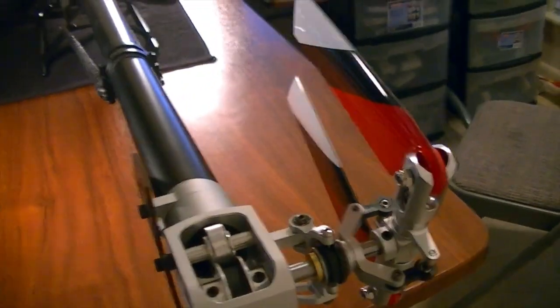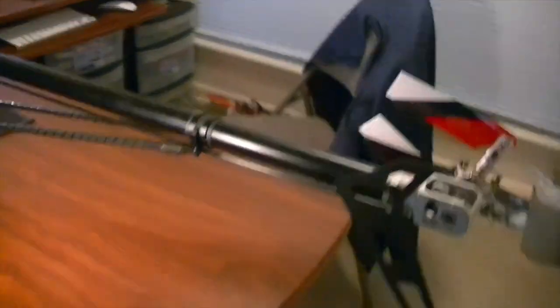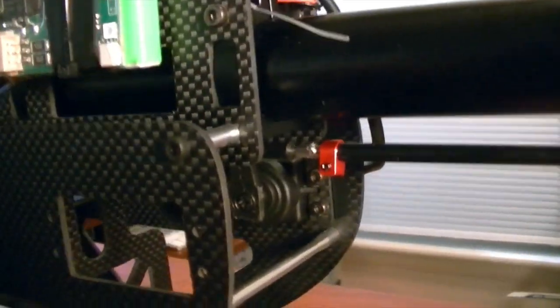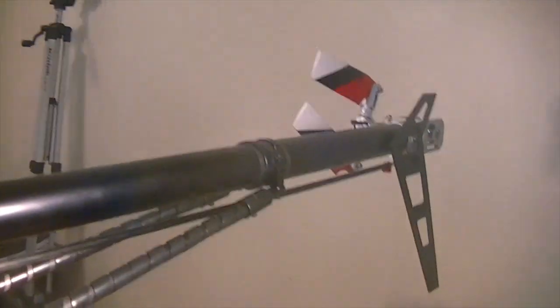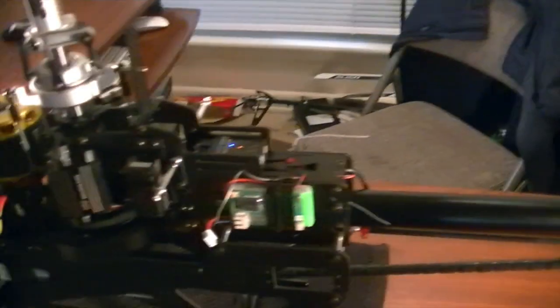So that's step number two. Make sure that your tail blade linkages and your grip arms and everything in here is all neutral. So we want no angles on the blade, 0 degrees, okay? This part can take you a couple of tries. It's very finicky. Just always keep coming back here to your reference position. Make sure you're sitting at that 90 degrees. Adjust your linkage as evenly as possible from both ends too. That way when we're getting torque and pulling on the rod, we don't risk having a slip out or anything like that. So get this stage done, okay?